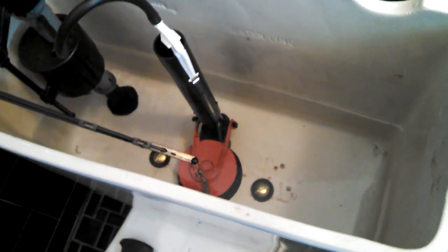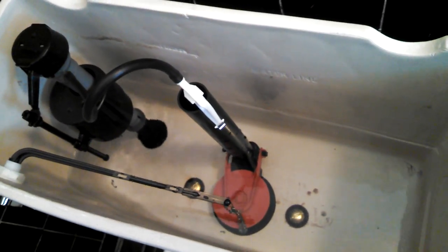Now there's a couple inches of water in the tank. I'm opening the flapper with the handle, and I'm checking underneath, because if that gasket was bad, if we did a bad installation, it would be leaking from either around the back bottom there or around the sides or around the front. And here we just filled it up all the way, and again we're flushing it just to double check that the flapper closes and that the water's not spilling out from underneath the tank, and our bolts are holding water, and our rim feed and everything is checking out good.